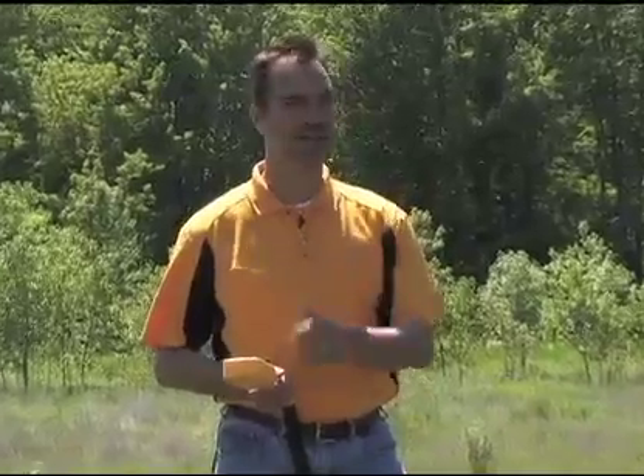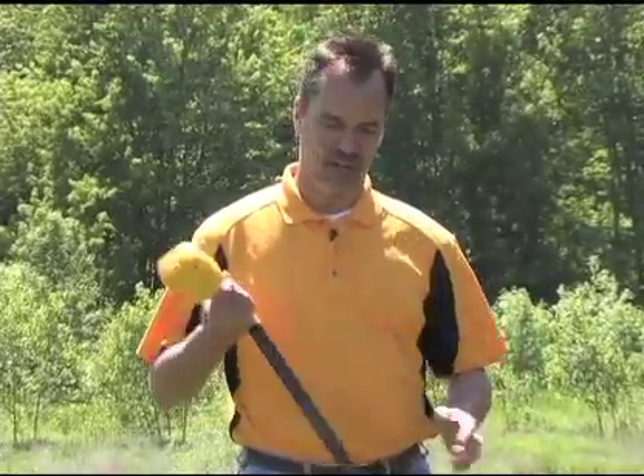This is a great example of bleed over. The cable you're directly connected to is setting up an electromagnetic field around it. The receiver senses that field and gives you an audible signal. When another cable or conductor runs through that field, it also picks up some of that signal — that's called bleed over. By using the technique just shown, you can distinguish which of the two is your connected cable and which one is not. A couple of factors on bleed over: the longer a cable runs alongside another cable, the more bleed over it's going to have; the closer the proximity, the more bleed over it's going to have. That's a simple technique for discerning which cable is the one you're actually connected to.